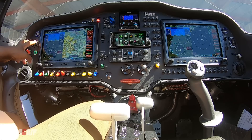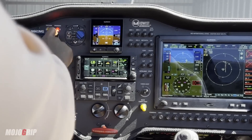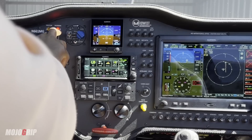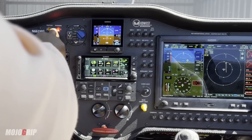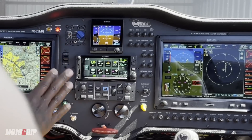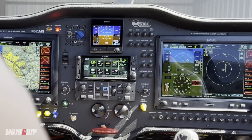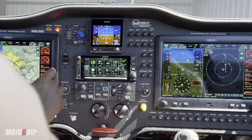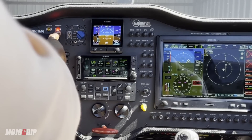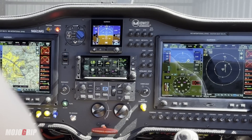You've got lanes one and two and you see this warning light here. If I was in flight and this comes on and stays stable, that means I've lost redundancy and I would have to act in that situation. When this is flashing, it's generally okay, and you have a caution light here too. When these lights are flashing, it means things are working as they should. But if I had a static light like this in flight, that would mean something is up — one of my generators may have failed or whatever the case may be.